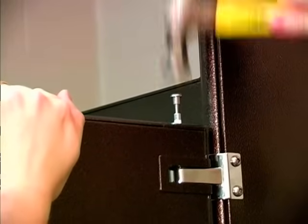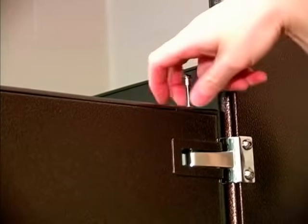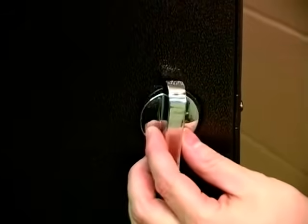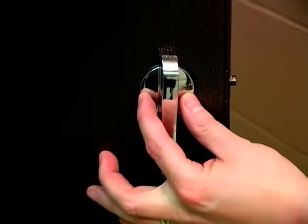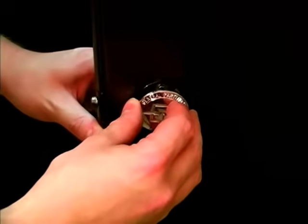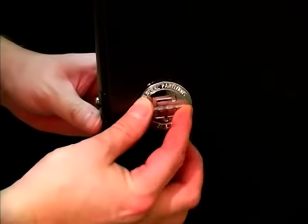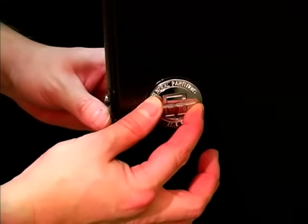Make sure the door is set to the desired position and tighten the lock nut on the bottom hinge bracket. Push the top hinge pin all the way until it snaps into place and remove the through bolt from the hinge pin. Install male portion of the concealed latch through the door from the inside of the compartment. Use lever latch on a handicapped door. Align the female slotted cover with the pins from the male side of the latch. Press firmly until it locks into place.